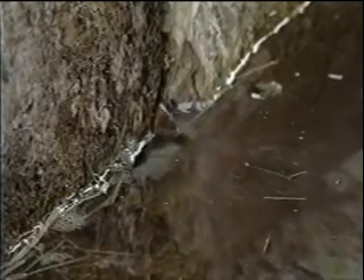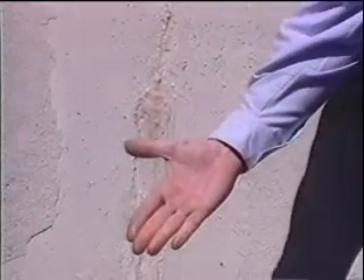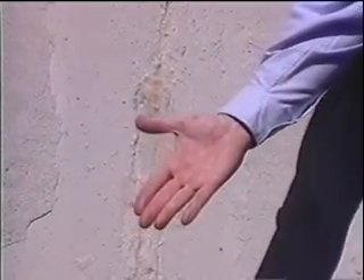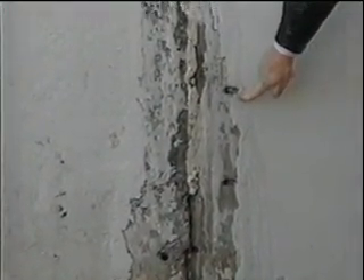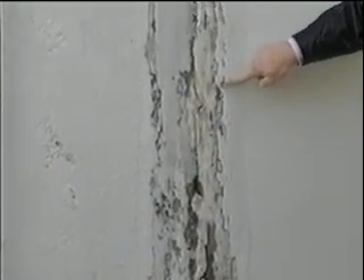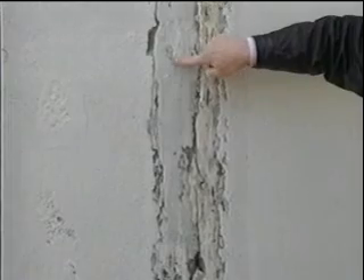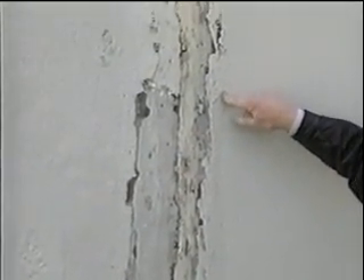The joint we will fix has some water leakage. Cracks with flowing water are not a problem — in fact, we prefer them. If a crack is not leaking at the time of repair, there will still be enough moisture in the concrete to react the grout. However, to expedite the process, water may be introduced to the area by squirting some into the holes you'll drill. A poultry baster or water gun works fine. Because of its hydrophobic characteristics, a small amount of water will completely react the grout.